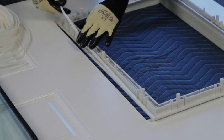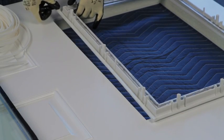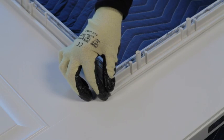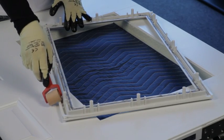If the existing glazing tape is damaged, apply new glazing tape to the exterior light frame. Make sure to overlap at corners, but do not stretch. Use a roller tool to be sure the tape adheres to the light frame.